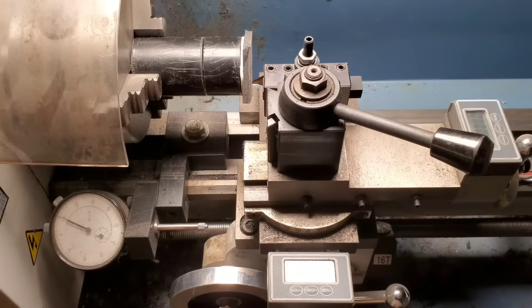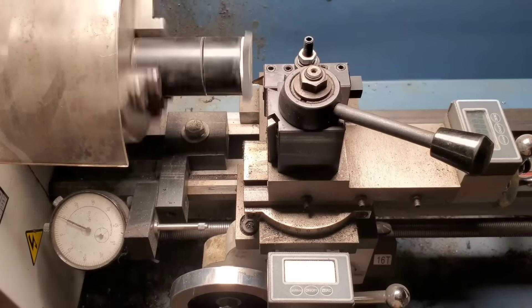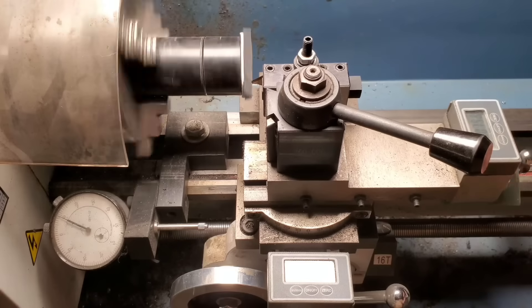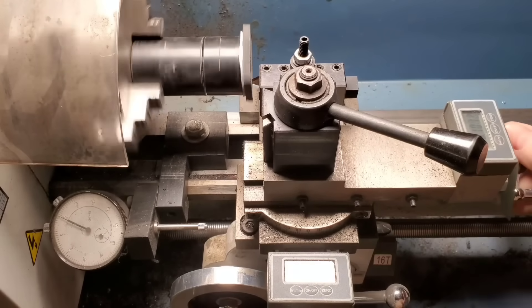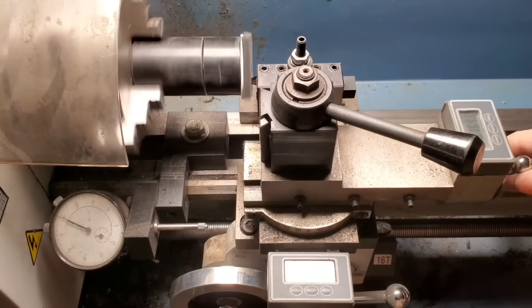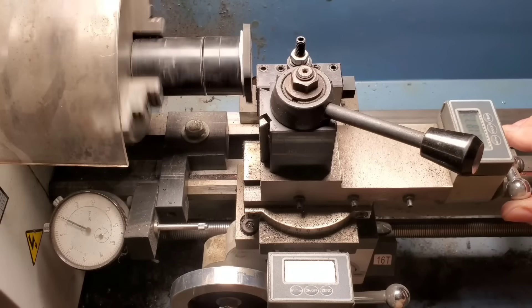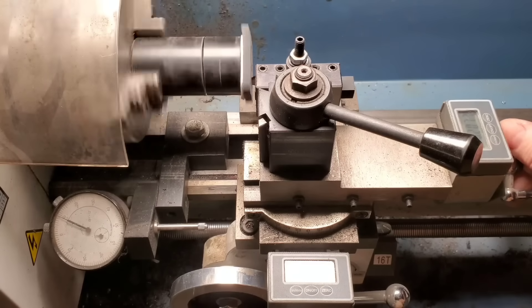So I'll make the cut. Running it slow — you don't want to run it too fast or the razor blade will just rip that piece right off and you have to start over again. On this particular readout, I'm going to go in a little over 187 thousandths. We'll proceed in slow. There's 187 right there, and then we take it in maybe 20 thousandths more, so 207.